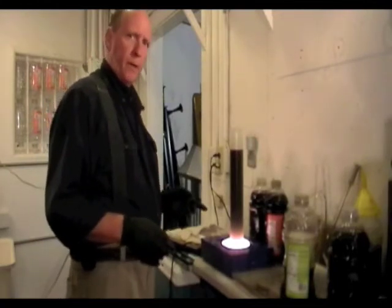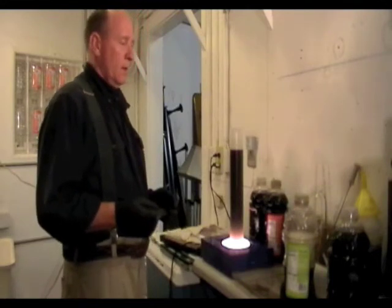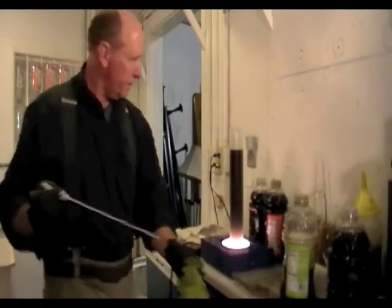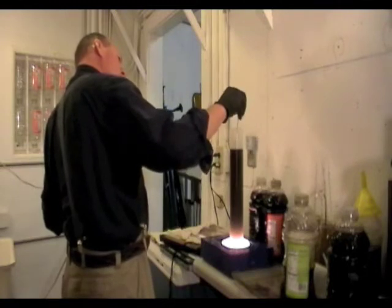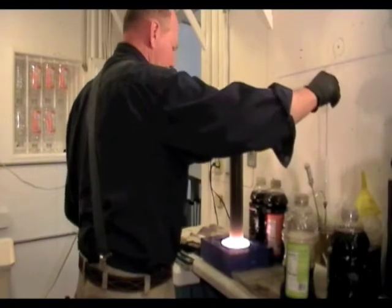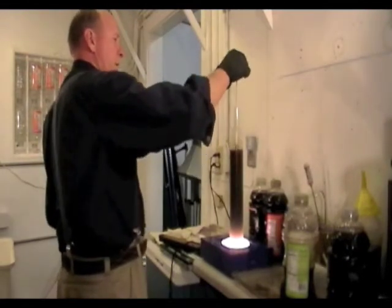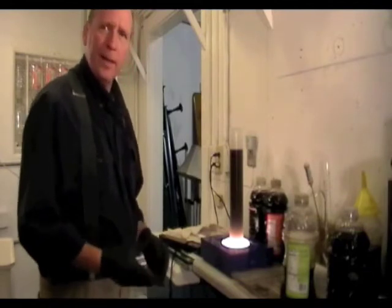Okay, so I withdrew 5 gallons of something at the bottom of my blending tank that didn't even have the smell of gasoline. It only smelled like vegetable oil. Then I extracted another sample. Let's measure its temperature and see what we've got. 64.0, or 17.8. Okay, now let's measure the specific gravity. And it's still very dense. So I'm going to keep extracting oil from the bottom of the tank until I get something thin.